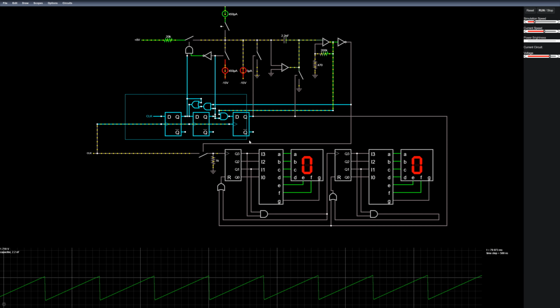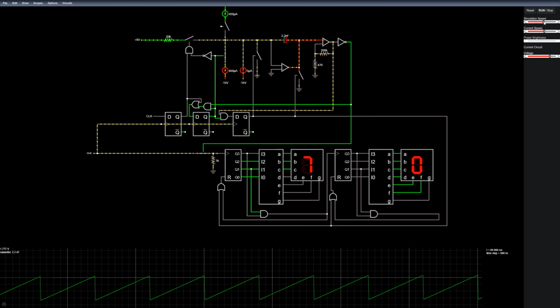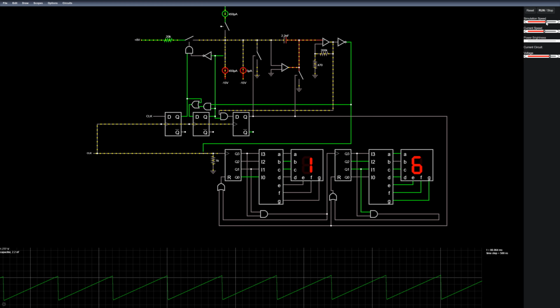It's based on a programmable logic device and a stable clock signal. For a specified time, they let the voltage to be measured charge a capacitor via a precision resistor, only to discharge it again via one of multiple precise current sources. In a perfect world, the time it takes to discharge that cap would only depend on the initial input voltage. If you ever find that perfect world, let me know.